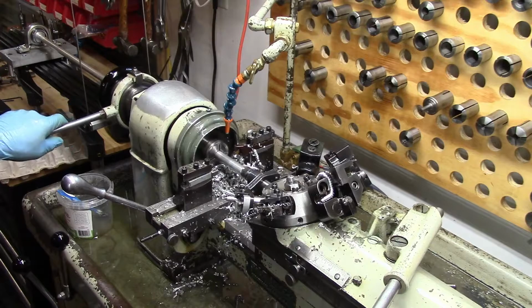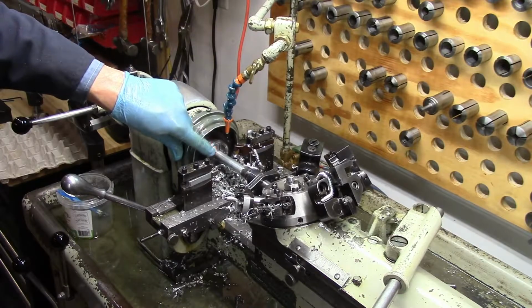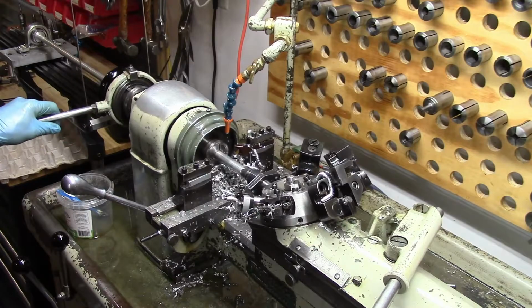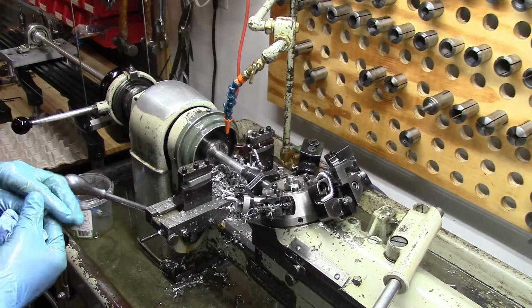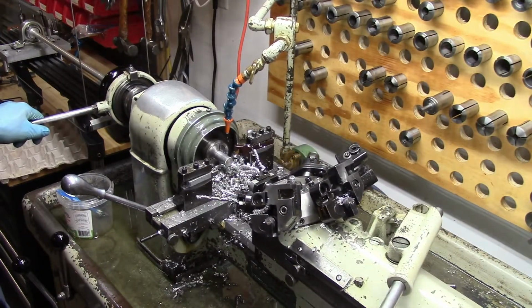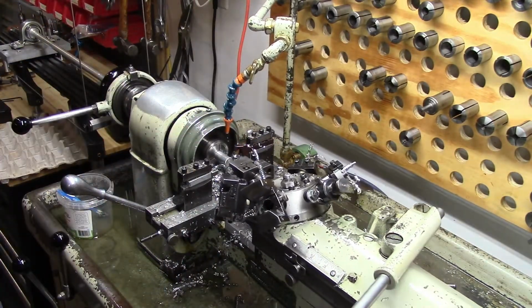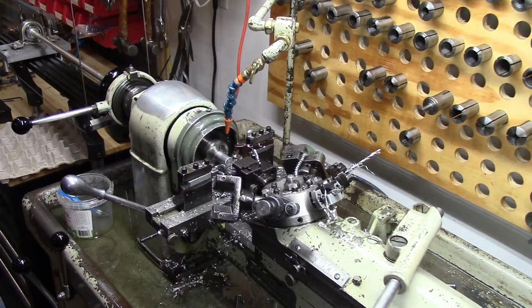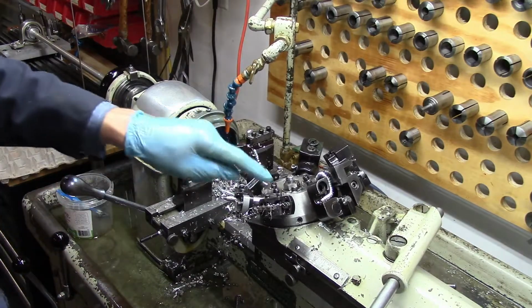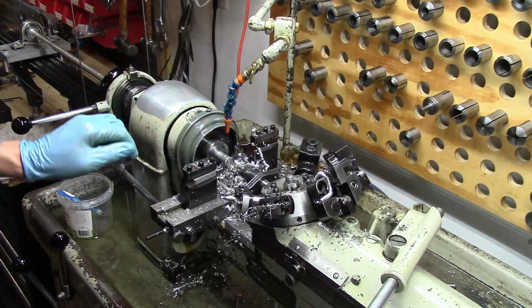And I open and close this right here, which is called a collet, and that holds the workpiece, either loosens it or tightens it. And then by drawing back this hand lever, which is right here, the turret indexes around, and you can perform all the various functions on it. And you set the turret for depth. Each station has its own depth.